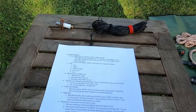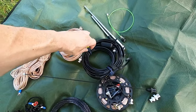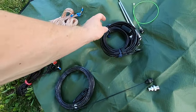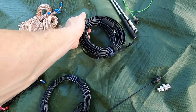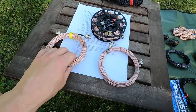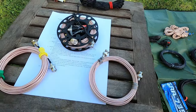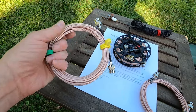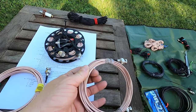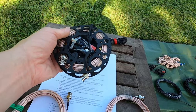Let's talk about coax for a minute. First we've got to consider size — how big an amount of coax are you willing to carry? I've got three different lengths of RG316 here. This is normally my go-to coax for in the field. On this 3D-printed spool, that's 33 feet of RG316. That's a 25-foot spool, and that's a 15-foot spool. The length I use most of the time is 25 feet — it's a good balance between bulk, weight, and enough length to get the job done. Remember, the longer your coax, the more loss you're going to have.